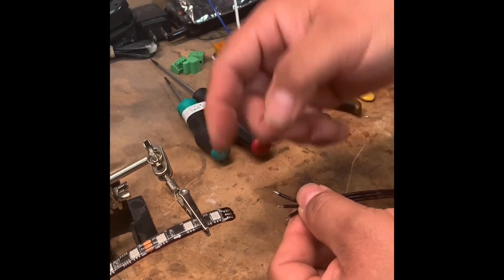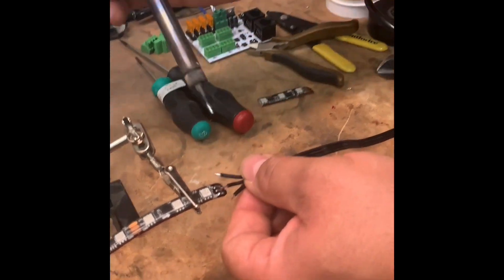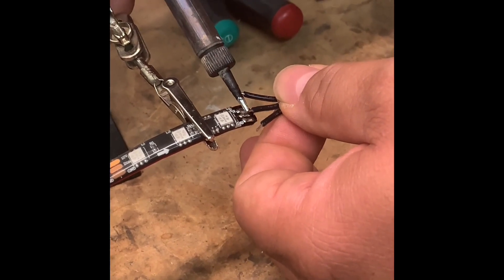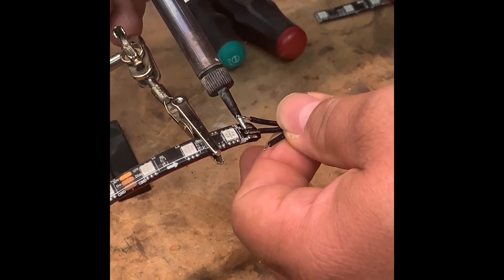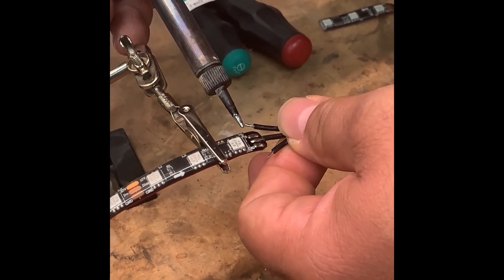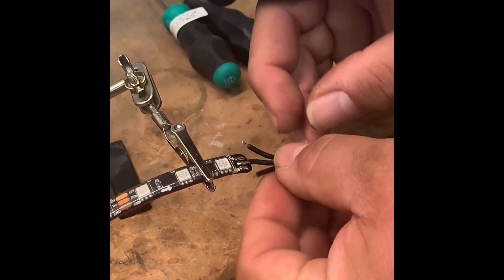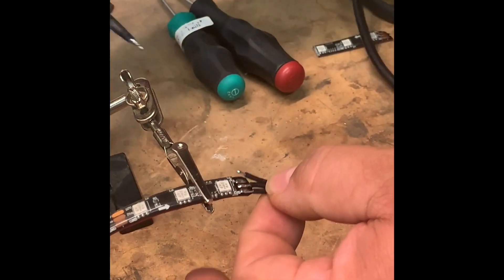I always start with the data or the center pin. This is a matter of just putting the soldering tip on top of the wire. I start with the center pin — it's a lot more easier to control and avoids much of a mess.